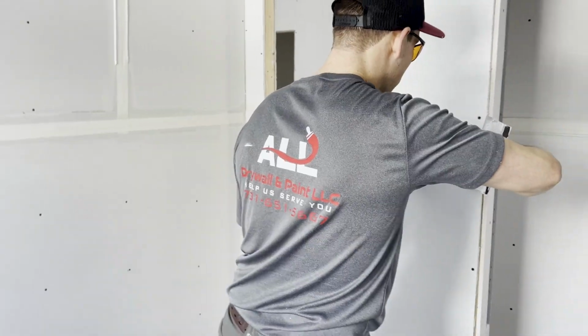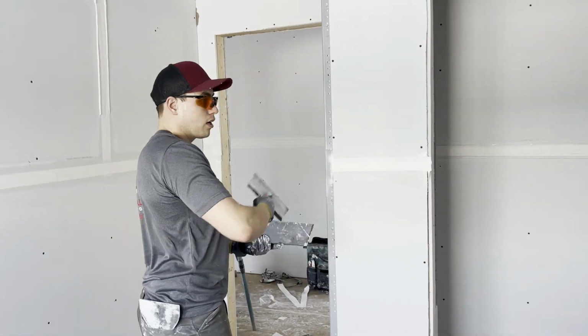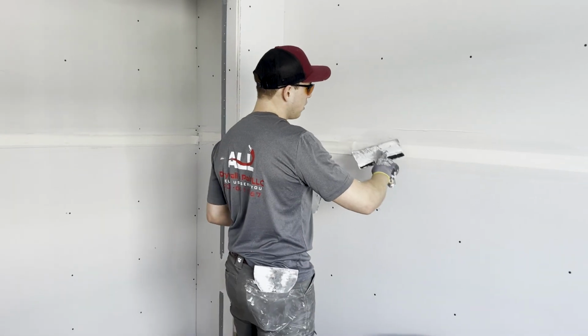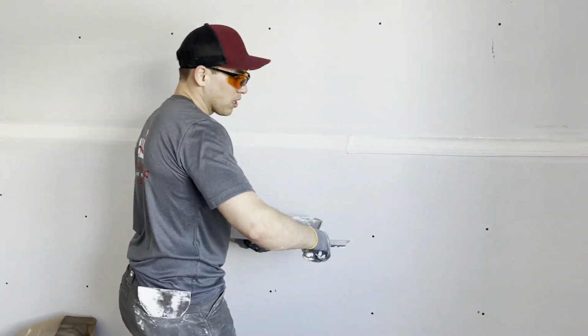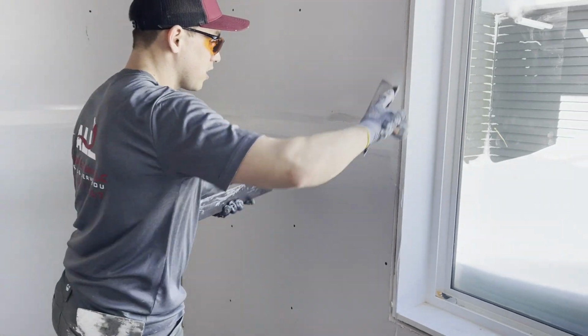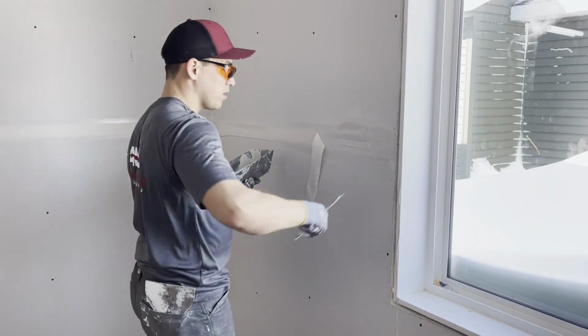And you're wiping. You want to make sure you clean all the mud off the walls. You don't want to leave stuff like this. Then it'll dry when you come in with the skid box, which you'll see in the next process. Then you get crusties. And I'm a crusty phobic, so we don't want to put crusty all over the job. Here's a hot mix kind of bulb style.